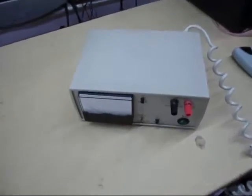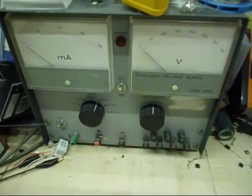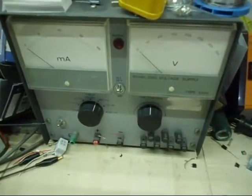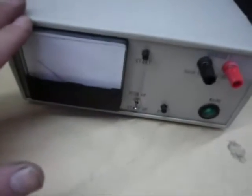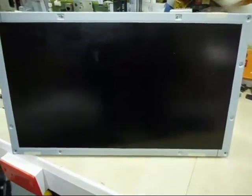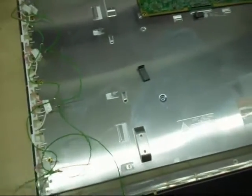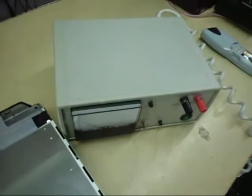If it's an LED screen you want to test, it's no problem - you can light the screen with a variable power supply that goes up to 350 volts at 200 milliamps, which will light the LED screen. If it's an older screen that uses cold cathode display tubes, you're going to need about 1000 volts to light up the tubes. So this is a high voltage generator with a safety interlock so you can't switch it on accidentally with one hand. I've wired all the cold cathode tubes inside the screen in parallel with two wires.